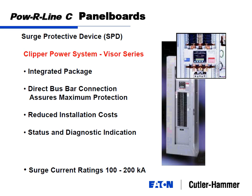The SPD will knock that down. You may have things inside your facility that create transient voltages: your copy machine, your fax machine. The nature of these electronic things, ballasts, the nature of the electronics will put transient voltages across basically your entire facility. It'll go up the line into your panel board, maybe into that next panel board. And by being able to chop down those transient voltages to a more tolerable level,